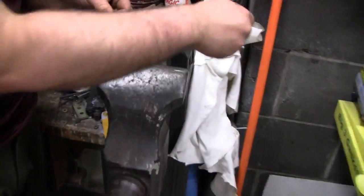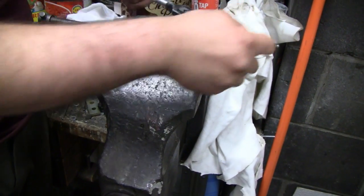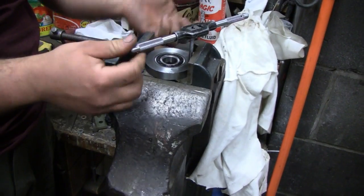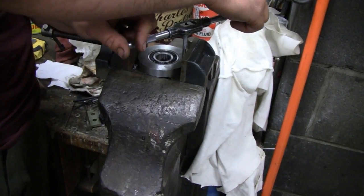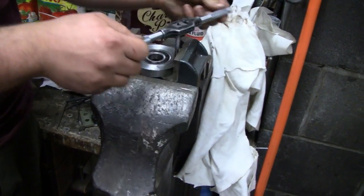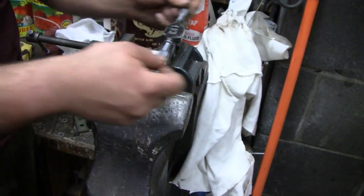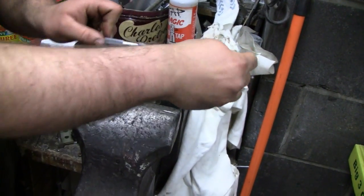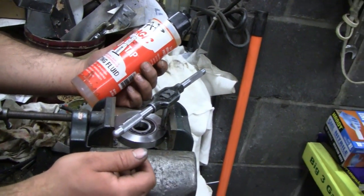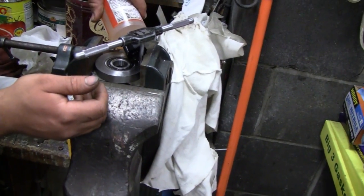Let's see what Mike is doing — I see the taps out. I'm just threading the first hole here. So I punched it and marked it, and what I'll do then is bolt this bearing carrier on with the guide in place so I have a free hand while I mark out the remaining holes. This will just be extra added insurance that the bearing carrier remains in its correct location. What are you lubing it with there, Mike? It's a specific tap lubricant called Tap Magic — cutting fluid. That's pretty much top of the line. Give a little squirt of that every once in a while.